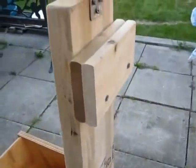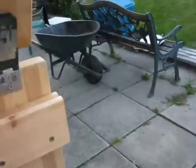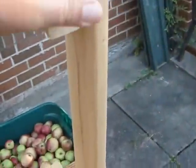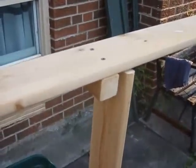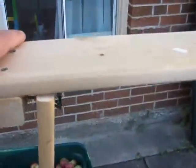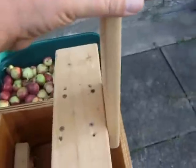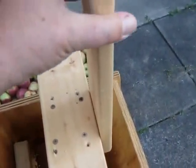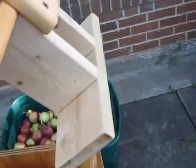There's a simple little handle on the back so when it's tilted, you can hold on and wheel it around. The arm comes down and the wood at the bottom helps push the apples down. I didn't have a hinge, so I just used a couple of long nails, bent them with some twist tie to allow the arm to swing. The top piece of wood prevents the bottom piece from getting crushed up in the crusher, and the apples get pushed with the bottom section.